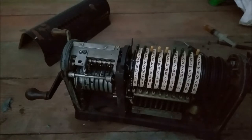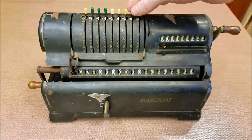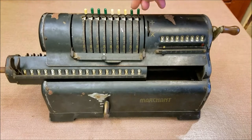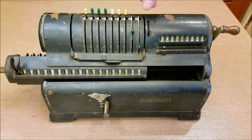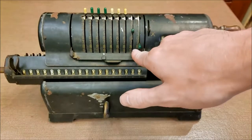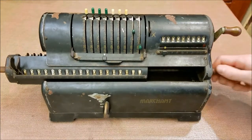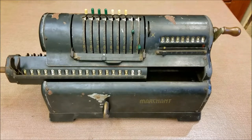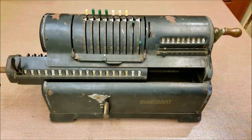But let's put it back together and see if we can do some division. Alright, so I got this thing all back together — let's do a demonstration. So we set our number we want to add — actually, first we move this all the way out so we're pointing at the zero position, then we set the number we want to add up here. Say 58 — you can either read it this way: 58, or read it that way. Then we turn the handle, going down first, and that adds it to the accumulator, also increases the counter each rotation. We can clear this, set our next number, and it adds.